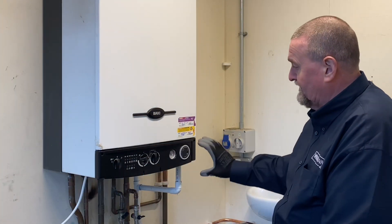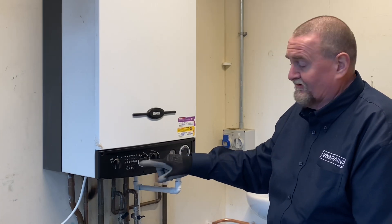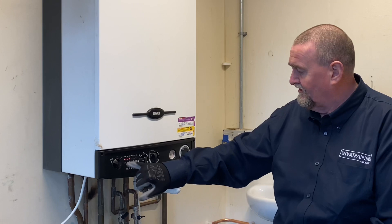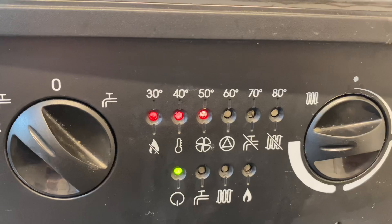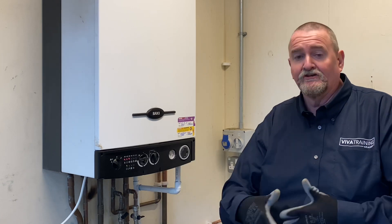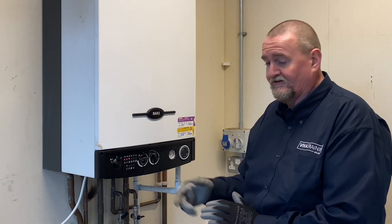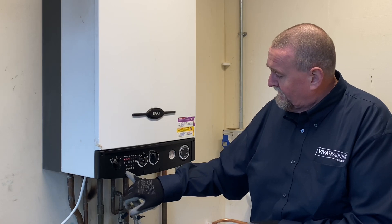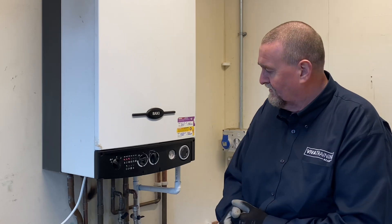We're going to go through the lights explaining what they do. The top set of lights have a double function. Turning the boiler on to heating and hot water, the first three red lights come on - they're not indicating a fault, they're actually indicating temperature. So with the 30, 40, 50 degree lights on, it's saying the core temperature picked up by the flow thermistor, the central heat thermistor, is around about 50 degrees.